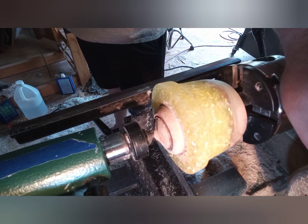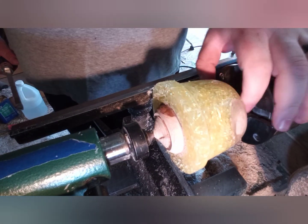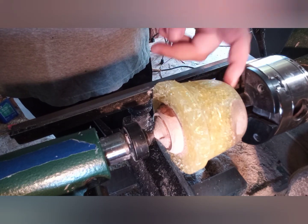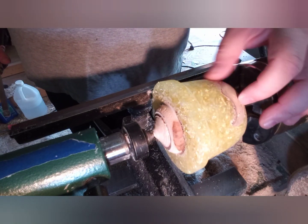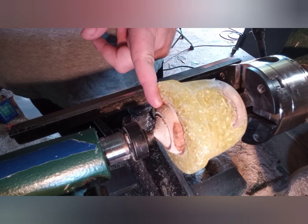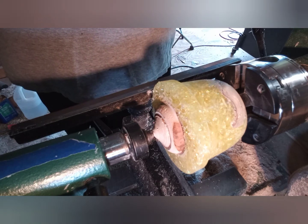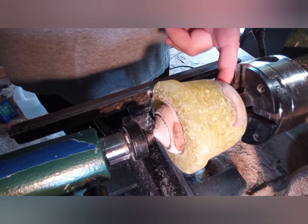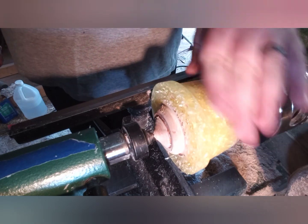You've probably seen the last clip - I had this come off the lathe. I should have known better probably than to use this chuck, and I don't think I made my mortise deep enough. To fix that problem, I got it mounted back in the chuck. I have a tailstock support in here. I'm going to use the remaining nub to try to cut a mortise or a tenon on this side, flip it back around, and recut this to fit a different chuck and make it a little bit deeper to hopefully grip and hold on to it a little bit better.